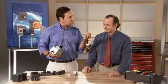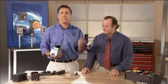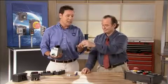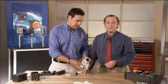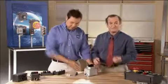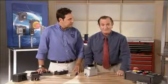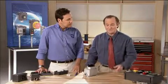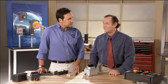Oh, you dropped something there. On many of these traditional boxes here, you've got these loose bolts. They're a huge frustration. You can only take them out with a flathead screwdriver, and then you got to find some place to put the bolts. You know, I've been working on the old style boxes and had these bolts just fall into other equipment. They get lost. And then, some guys, not me of course, put the box back together without all the bolts. There goes your safety protection.